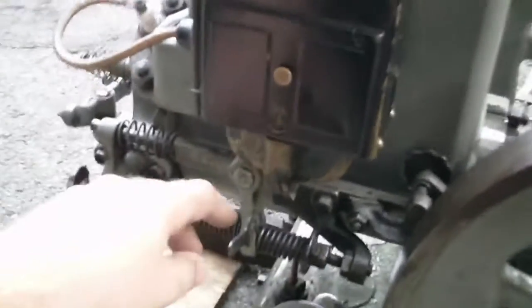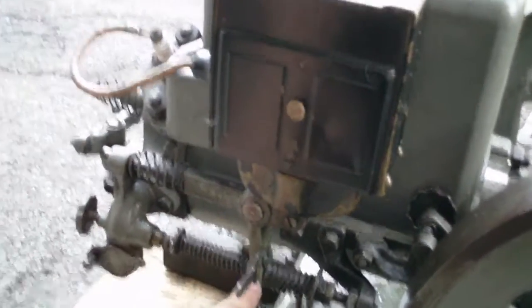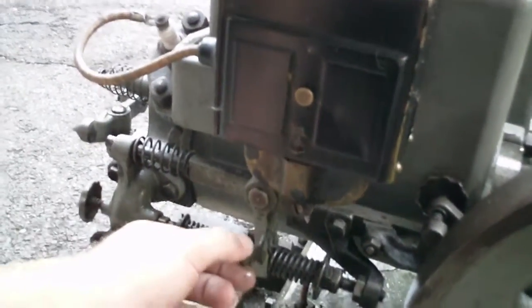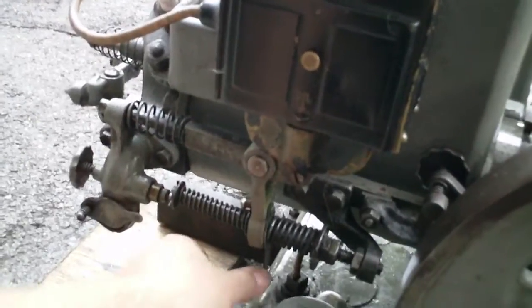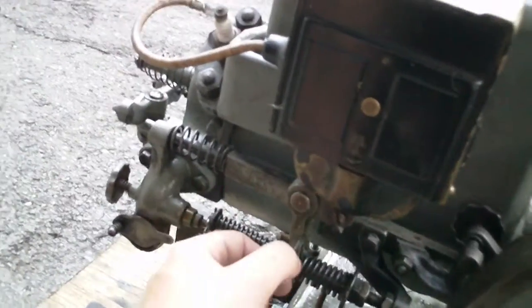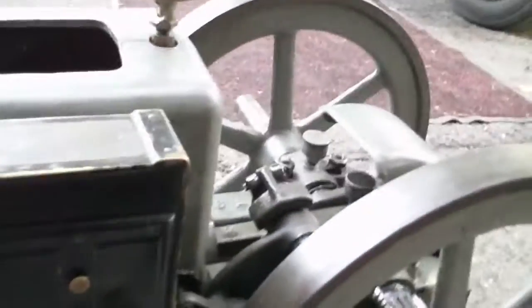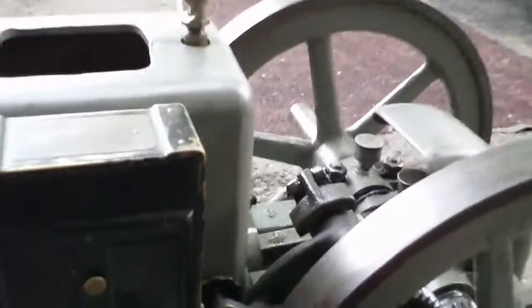With this little trip lever pulled out of line of this spring, this plate is not quite as thick. When this is pulled up and this pushed down, the spring pushes this first before the plate, which means it's this much thicker. When I pull this out, it happens later in the cycle — thus retarding the spark on this engine. If I roll this engine over in this direction, we're going to go back to where it's normally going to spark.